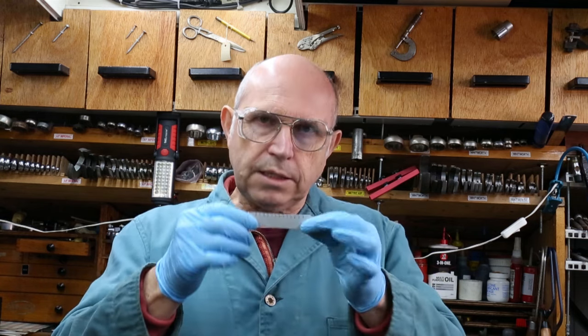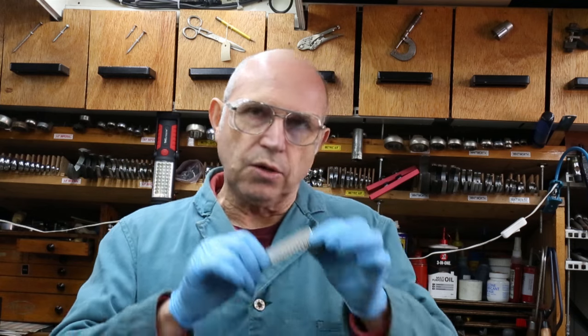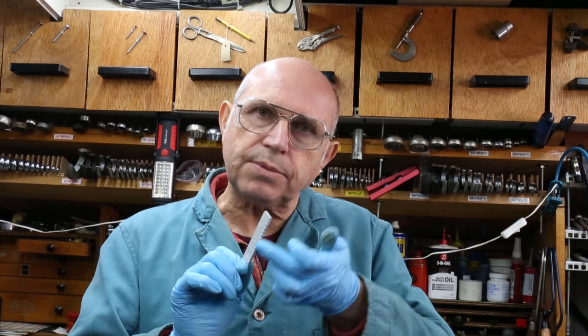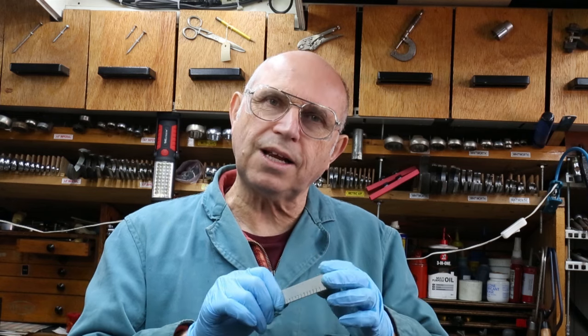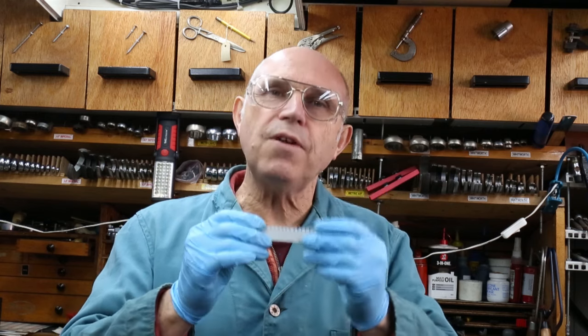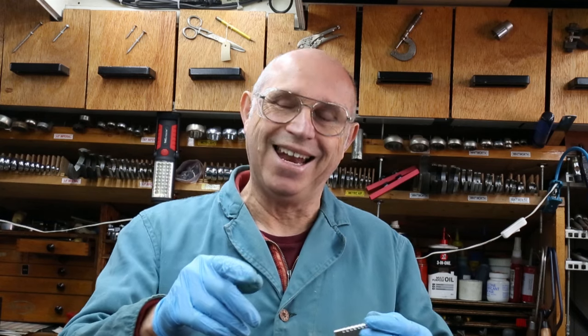So you now know how I clean my round files and my half round files. When you make a little scraper like this it does take a little bit of practice to get used to it — you've got to be very careful and keep it in line with the teeth, otherwise you mess up the shapes that you've cut on there so the profile doesn't match the teeth you're trying to clean. A little bit of practice and you will find this will work very well for you. With that, this video is at an end — take care everybody, I'll see you next time.